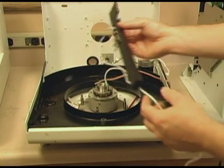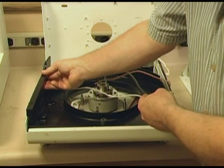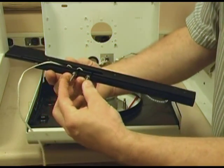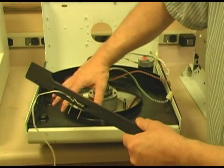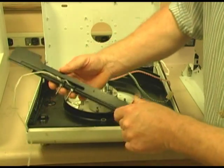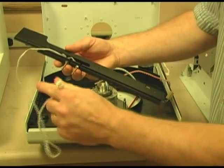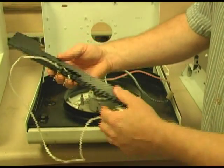This is a side assembly that holds the waste shroud in place. Underneath here you're going to find two bolts — that's the sensor to determine if you get too much reagent and waste into this bowl. They essentially short out and send a signal. The key thing is they're just bolts, so you can ohm it out quickly if there's any issue there.